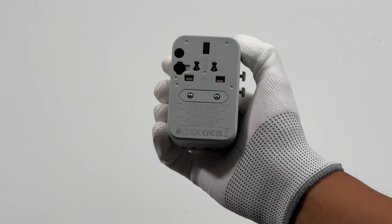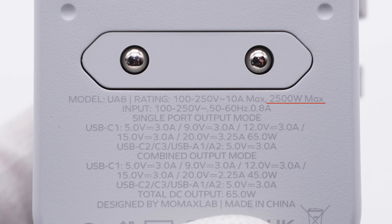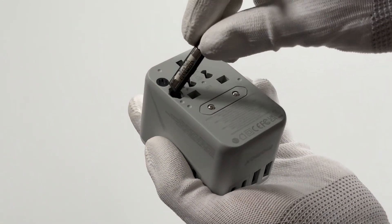Let's take a close look at the specs printed on the back. The model is UA8. The AC part can support up to 2500W, and the DC part can support an input of 120V, 50/60Hz, 0.8A. The output power of USB-C1 can be up to 65W, and the other four ports only reach 15W. When charging two devices at the same time, the power of USB-C1 will drop to 45W. Finally, the total output power won't exceed 65W. It also comes with two 10A fuses inside for emergencies, just like the 35W version.